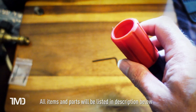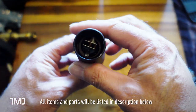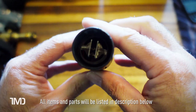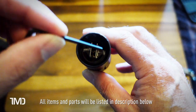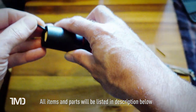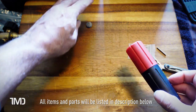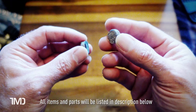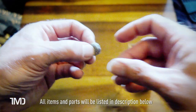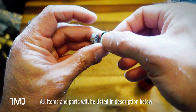Set the brass component aside. Now with just the nozzle, we're going to remove the old filters. Open the nozzle up all the way, take the allen key, stick it down inside, and push down the center — this pops the filters out. There they are: two stainless steel filters and the foam filter sandwiched between them. We're going to replace all three.